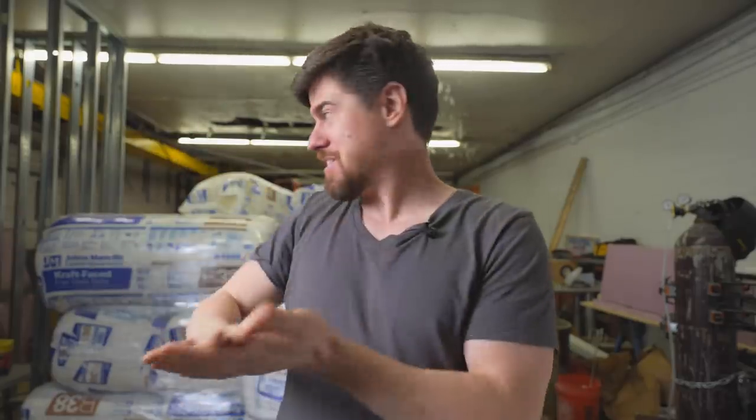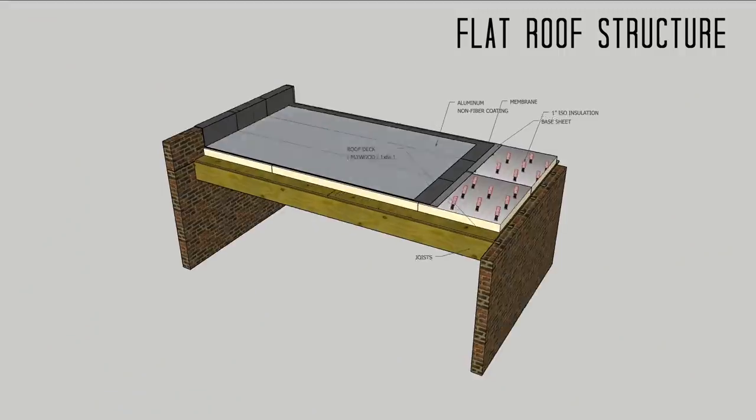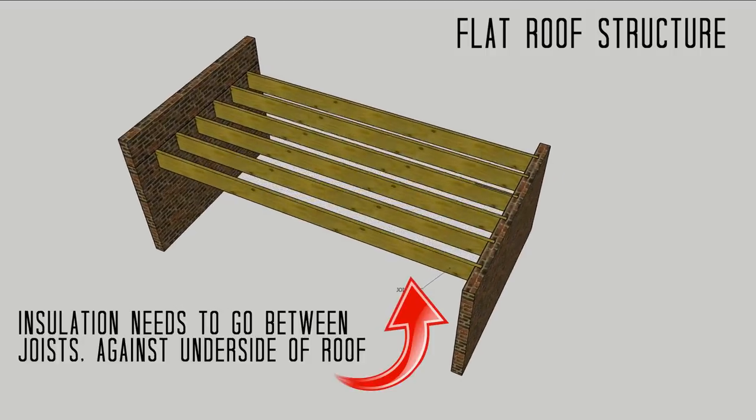And that's important because the attic is a big open space of air that actually provides ventilation that is needed so you don't have a massive mold problem on your hands. I have a flat roof, which means it was gonna be installed right against the roof with no air to allow for ventilation above it. It would have been a recipe for disaster. It would have got extremely moldy.